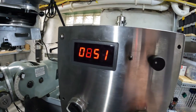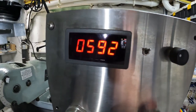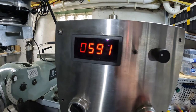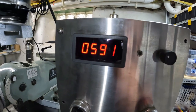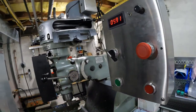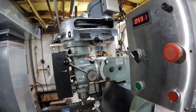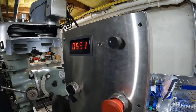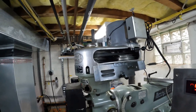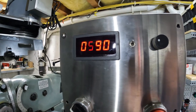You can turn it down slowly — it will eventually catch up. At really low speeds it takes a while because of the filtering, but it does settle out and you get the correct speed. And if you're wondering whether when the quill goes up and down it stays the same — you can raise it up and down and see the spindle going down while it maintains the rotation speed.